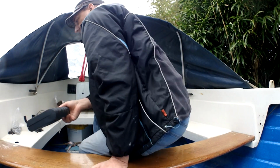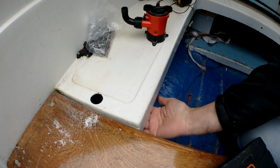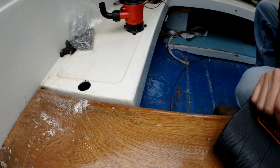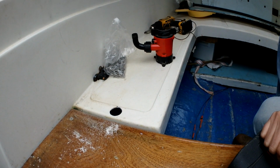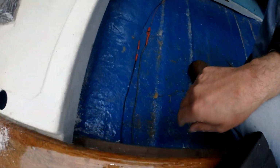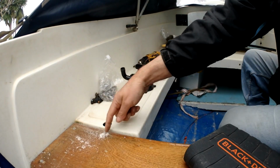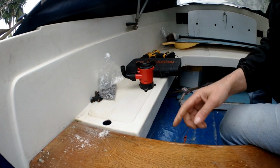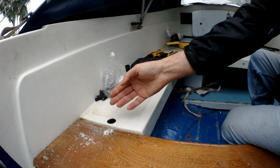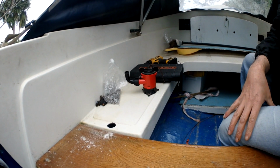And of course you saw that that hole that was there, we made the hole bigger. It'll have a plank, a piece of plywood with a hole as well underneath. The boat light and the radar reflector will go down through that pole. Now brace to under the seat down there onto this, through there, and then the sounder box will go here. The GPS and the fish finder, it'll be a reinforced box. And this will come up and that'll bolt to the back of the box as well, so it'll be braced there, so that'd be a good spot for that.